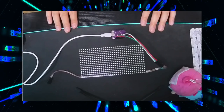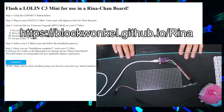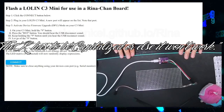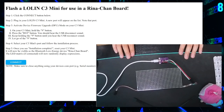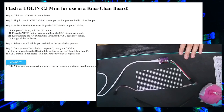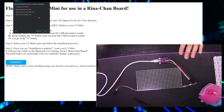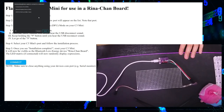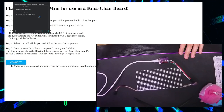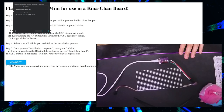So the website, the link below, blockwonkle.github.io/RINA. The R has to be capitalized or else it won't work. I checked. So let's follow the instructions on the website together. Step 1, click on the big blue connect button below. Plug/replug the C3 Mini so that we can tell which COM port is the C3 Mini. It looks like here it is the COM4 port for me, and that's just because I've got other COM ports in use.